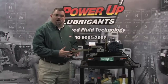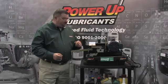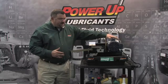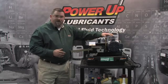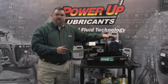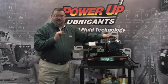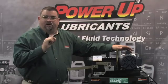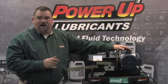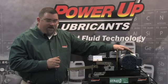Power Up — once Power Up is added to your oil, when your engine is loaded, it doesn't know the difference between light load and heavy load as far as how much energy is being burnt. We're lubricating that race and that bearing so well that it's taking the same amount of energy out of this electric motor to turn the bearings as it did when it had four or five weights on here. Once we've exceeded ten weights, we've started to enter what we call the boundary lubrication regime, where the oil film between those moving metals is less than three microns — and only the best lubrication modern technology can provide, which is in our product Power Up, will keep those moving metals separate and quiet without the metal shearing and scoring.